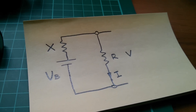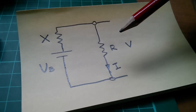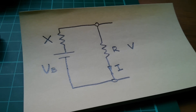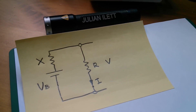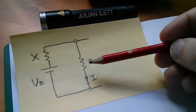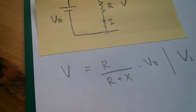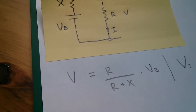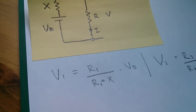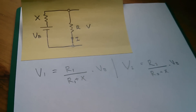What I couldn't work out is why taking two voltage measurements and two current measurements with two different external resistor values — and dividing delta V by delta I — why that would give you X, the internal resistance of the battery. It just didn't make sense, so I'm afraid that means some maths. This is a potential divider, so the voltage V across R will be R over (R + X) times Vb. We're taking two measurements, so: V1 = R1 / (R1 + X) × Vb.